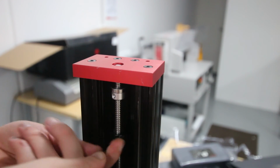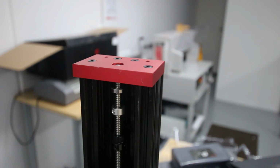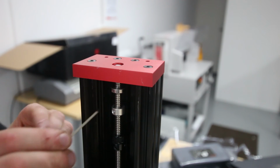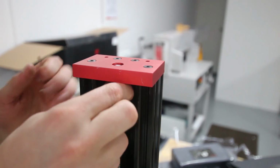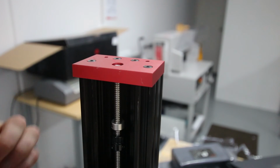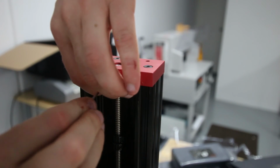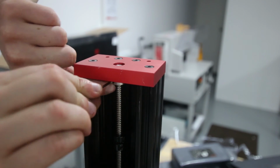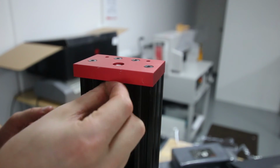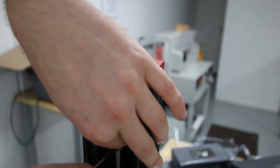Okay, so you're going to loosen that guy. Missed the grub screw in this guy, so put him in there. This bearing should slide fairly easily, and we're going to try to slot them up into this recess here, just so that it's nice and flush. Push the lock collar all the way up so it sits nice and flush with the bearing. Looks good. And this guy will adjust when we get to the Z-axis belts.